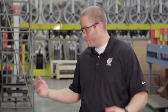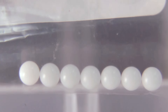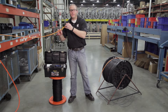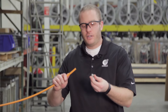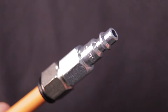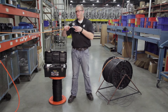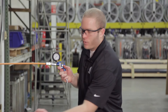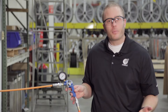Now that we have our cable grip installed at the end of our duct run, we'll come back to the beginning, find our appropriate size proofing ball that's in our duct kit, and insert the proofing ball into the ID of the duct and let that slide down in there. Then we'll take our coupling, insert our micro duct coupling onto our duct, make sure it's fully seated so it doesn't come loose, and take our pressure test gun, couple it to the micro duct coupling, and plug our air pressure hose into the pressure test gun.